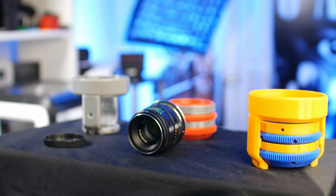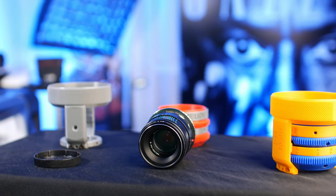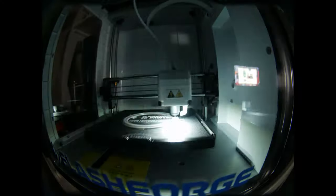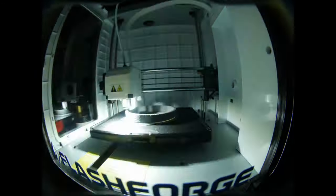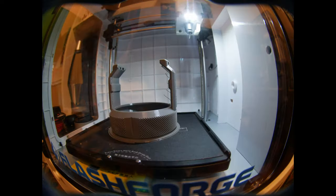While I was waiting for the Helios to arrive, I ended up 3D printing all the parts I needed, which I'm glad I did in the meantime because it's not something you can do in a day. To print all the parts I needed, it took about five days, especially with the kind of infill you need. When you're printing parts you actually want to use, you want more plastic filament inside the units so they don't break easily. I learned my lesson on the first few, because there are certain things you can't 3D print — like the screws and the EF mount — and if you don't have enough infill, it starts breaking.